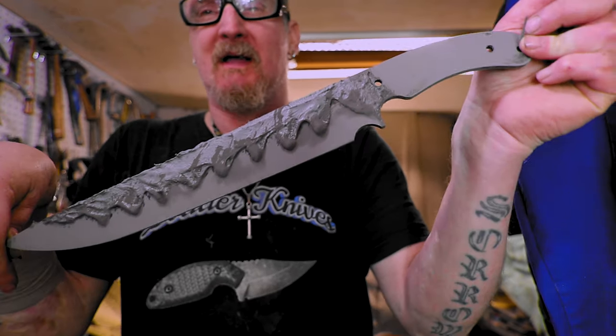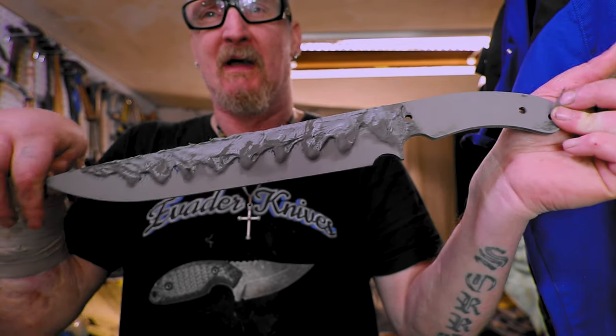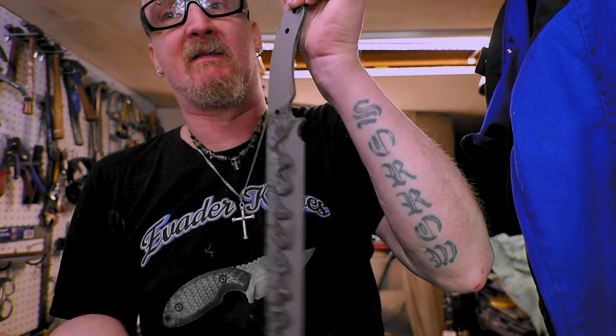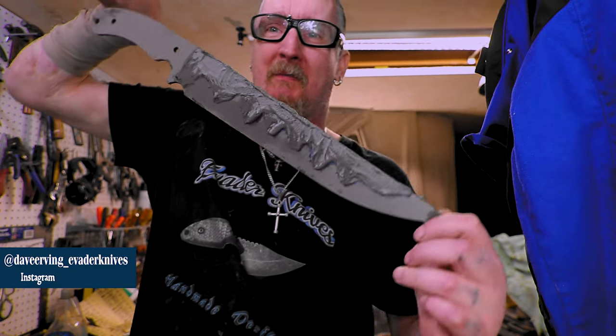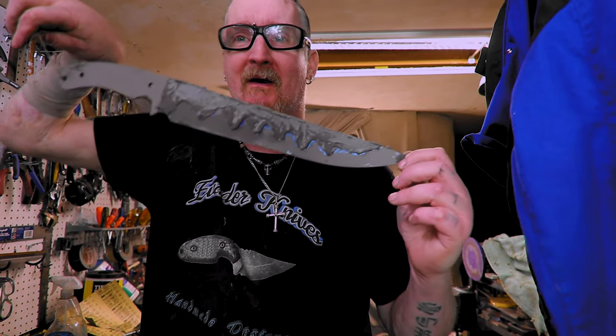I came down, it was like midnight, and I just shut off the oven. And I guess since the insulating bricks hold so much heat, when I came down in the morning, these were all blue, which means the heat treat was ruined. If you follow me on Instagram, you probably already seen that, but I'll put some pictures of the blue. Both of them, all three, the kitchen knives and this, were all just blue, which means they're less than a 55, so I'm redoing them.